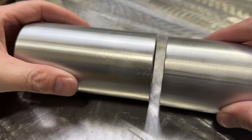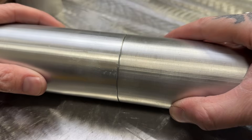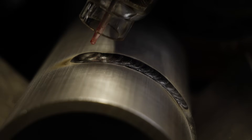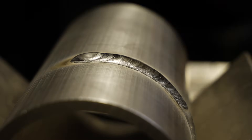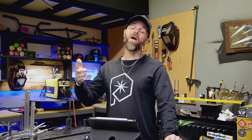Instead of just fitting up the joint you're going to work on and totally sending it, get a piece of scrap material that's the exact same size and thickness as the material you're going to work on, and just practice running lines around it. Why try to learn everything at once over an intricate joint like a butt joint on pipe, when you can get warmed up and dialed in with all of your settings and positioning on scrap? Once things are looking nice and tidy with that exercise, then jumping on to the actual butt joint configuration, you're going to have a much better chance of getting the results you want way faster.